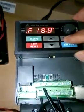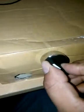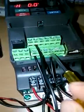M1 is connected here — I used M1 connected to the selector switch, and M2 is connected to the second selector switch. I'm going to use forward start and stop, and reverse start and stop. These two buttons are used to operate this motor. The second terminal of the switch is connected to the DC common.